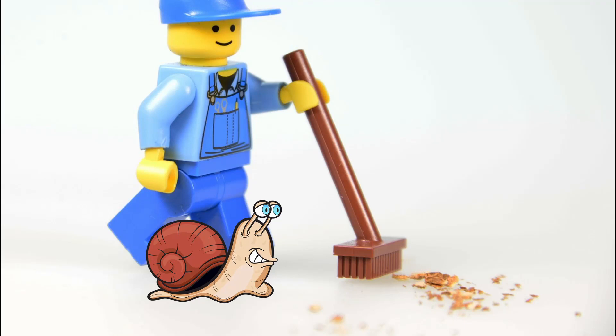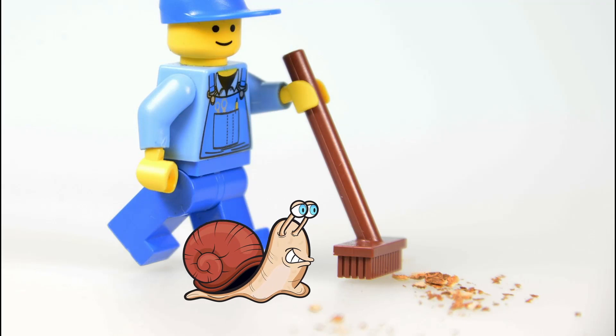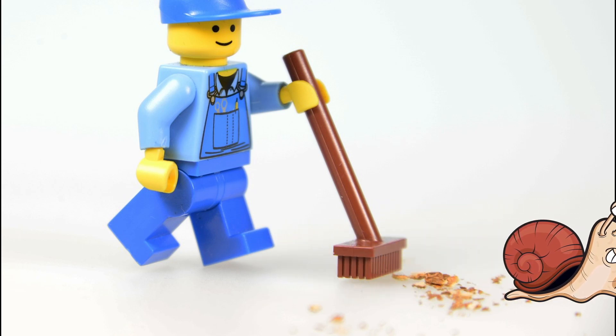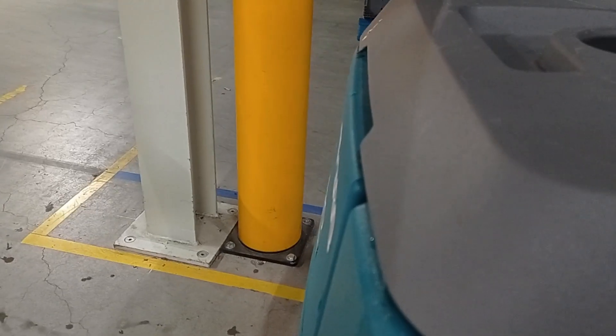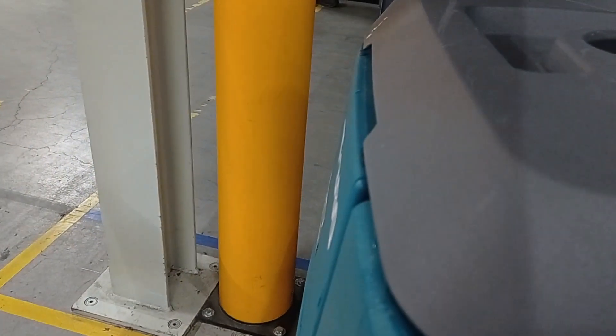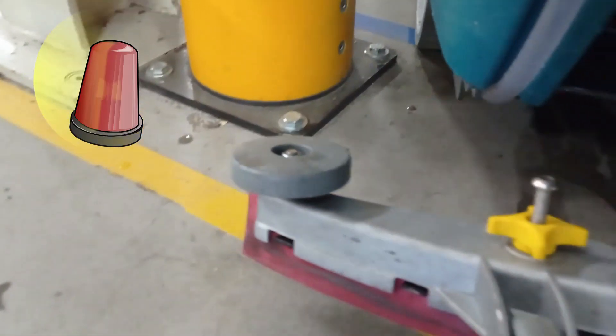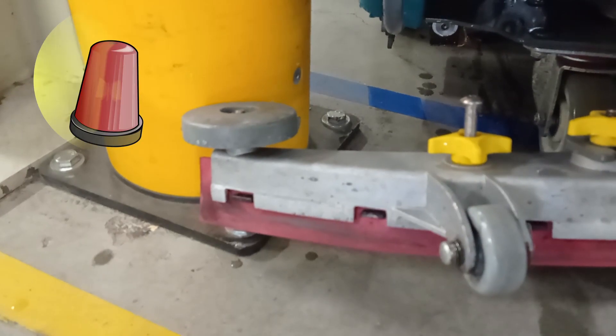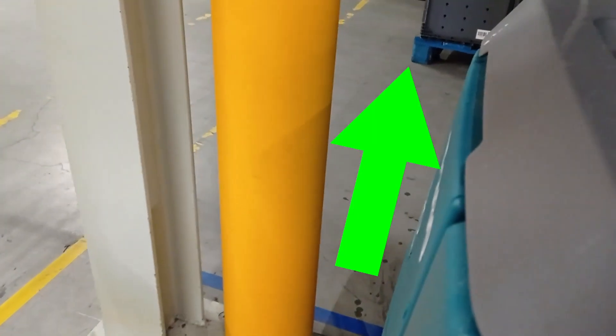Travel speeds will affect the scrubbing — when travelling too fast, the floors will not be cleaned effectively. Extreme caution must be taken when turning next to poles or barriers, as the T300 cleaning machine can turn very sharply and the machine can easily be damaged by hitting obstacles. Always ride past the pole or barrier before turning to avoid hitting the obstacles.